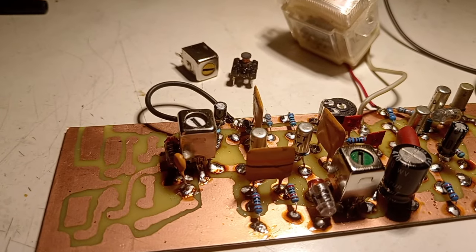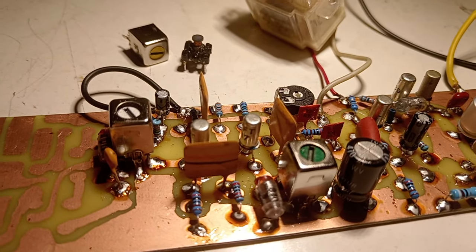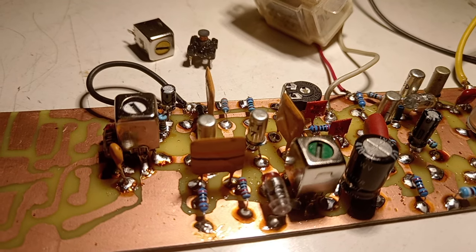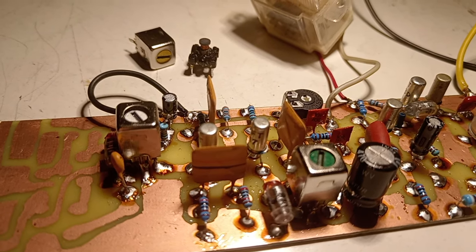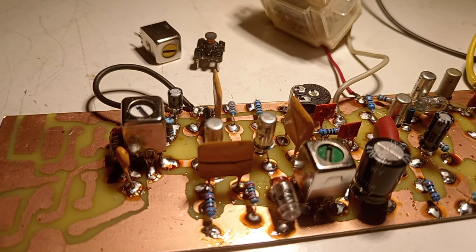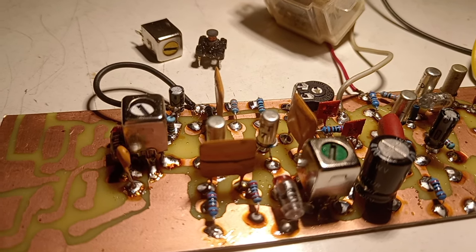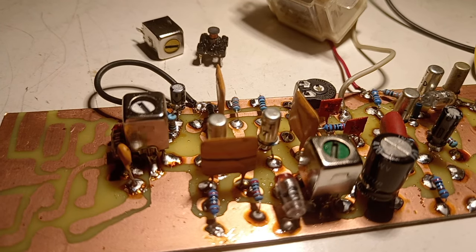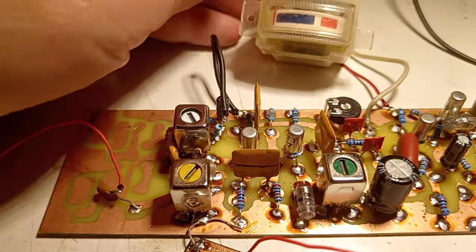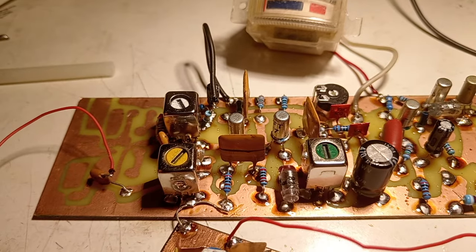So for the first coil of the intermediate frequency, I'm gonna use that yellow coil, yellow core. The original number of turns was 70 at the Technoton coil. So to be able to tune it with 1 nanofarad on this core, I think I will test 65, see if it tunes.